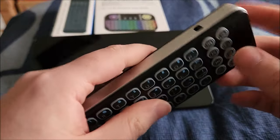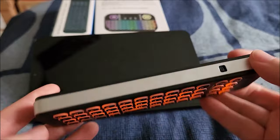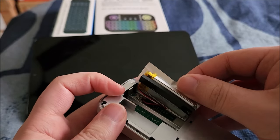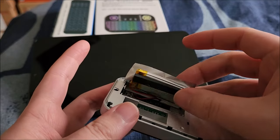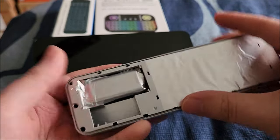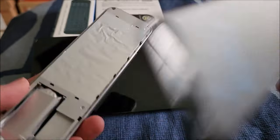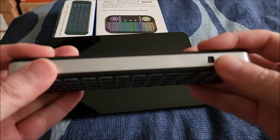I'll switch this on. I will say I opened this once and it's kind of a pain to get back together, so I wouldn't advise opening it unless you really have to. You can pull off the back to access the battery, but to replace the battery you still need to get to the board to desolder it — you'll probably burn some plastic or short the battery if you try to get your iron in there. So if you want to replace the battery, take it apart properly. One thing I noticed: this was designed to have extra functionality — there's a whole button pad on the back that's not populated and no secondary PCB, suggesting a higher-end model or a cancelled feature.